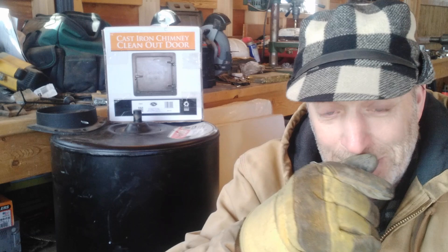Before I had made a rocket stove out of a hundred pound propane tank, but something like that wouldn't be quite wide enough or big enough in diameter to fit a water coil around the inside of it and still get good exhaust flow past it. So I had to find something bigger, and this is what I came up with. This is a 14 gauge steel tank that's 18 inches in diameter and 36 inches tall, and this will work pretty good — I can get everything contained right inside this steel tank.